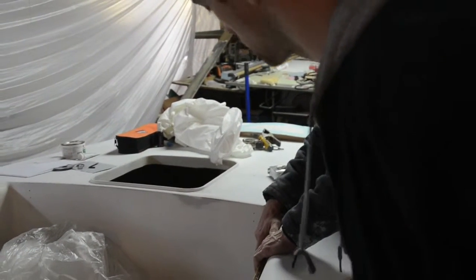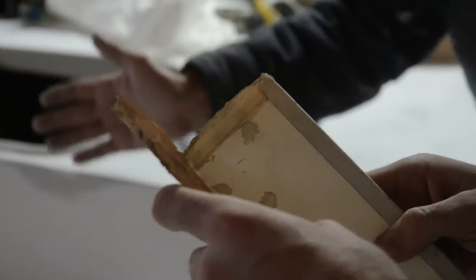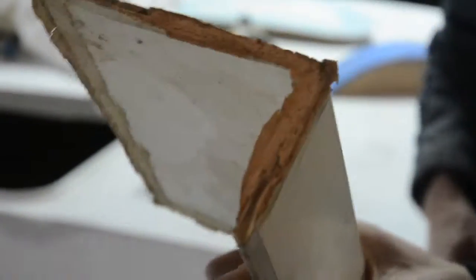We call that fiddle fussing. Wax the thing, paint the gel coat in the mold, put a couple of layers of glass in it, pop it out, and then do this on the other side, pop it off, invert them, and glue them together. But it ends up being so stiff and rigid, and that's just 3 pieces of glass.